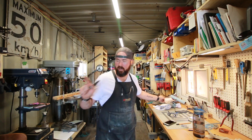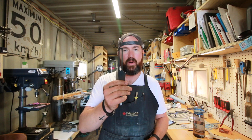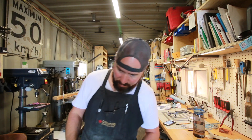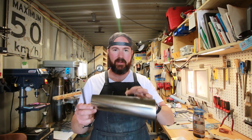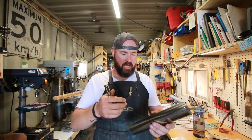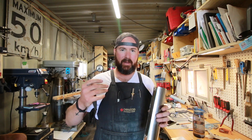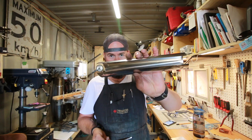The next step: I've got my kiln heating up. For heat treat, I'm going to do a 1400-degree soak for 15 minutes, then go up to 1920 degrees Fahrenheit, leave it there for 20 minutes, and then do a plate quench between two big chunks of aluminum plate. I'll also be wrapping this knife in stainless steel foil — a special type. We make a little pouch, fold the edges over and hammer it nice and tight to make an airtight seal, then put the knife in and seal it up. I'm going to put a piece of paper in there as well — as that paper heats up it burns all the oxygen off inside the envelope, heating the knife in an inert environment so we won't decarburize the steel.